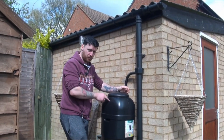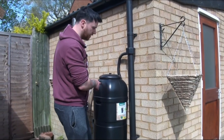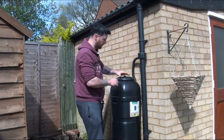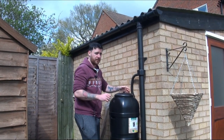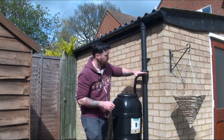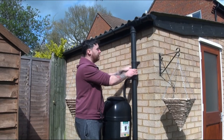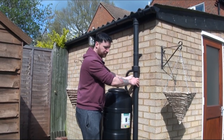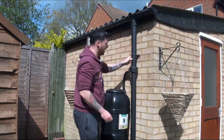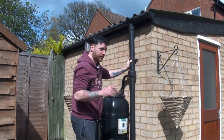What we had to do was actually drill a hole on the side of the butt. For placement, you've got pretty much guide holes where you need to drill in, make a little hole, and then you can attach the gland from your water pipe. What we had to do then was saw through the downpipe. The problem is you'll then have to do a bit of shifting — shift up or shift down the downpipe. If the fixings are rusted like ours, it makes it a very hard job, but luckily we managed to do it.